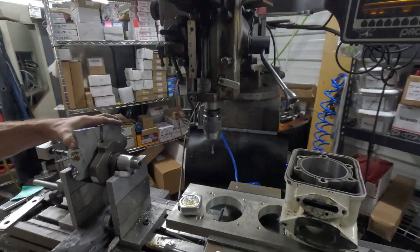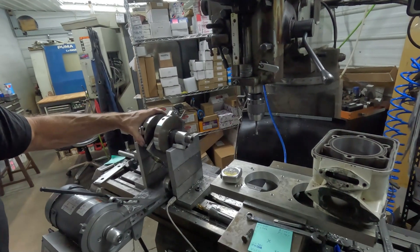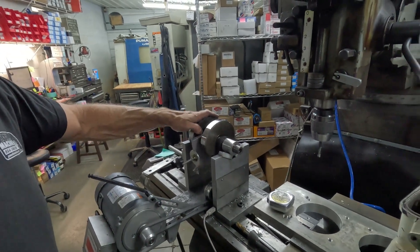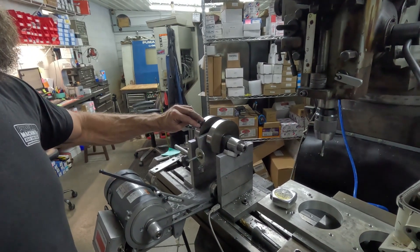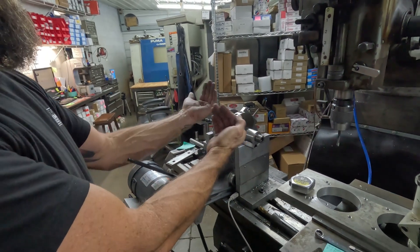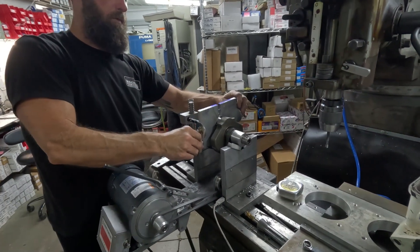Now we're at 7 and 13 — we're just getting closer and closer. We are still a little off. This one's getting over here heavy and this one's getting over here heavy because they've already got these holes drilled — so they're splitting the balance differently. We're taking material off all the way around, but it's taking less here because there's nothing already there, so it's taking more on this side. As we take more off, it's moving that out of balance over to where there's no holes drilled, but I still think we can take just a little bit more before we have to do any drilling.